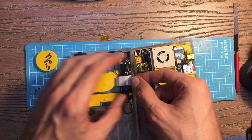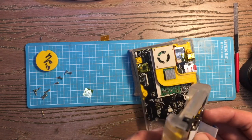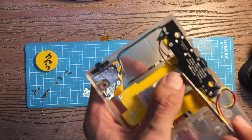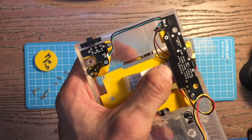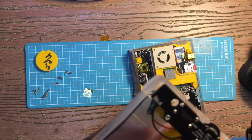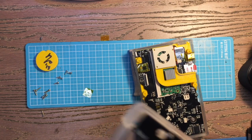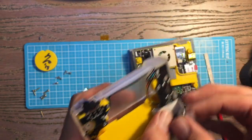Connect up the backboard between these — you can see that ribbon cable has little indentations from the nibbles on the board. Just like I did with the top bit, I'm going to smooth those down. There are little mouse nibbles from where the board was removed from its main piece, and you do not want that compromising the flat panel connector. You can also just knock them off with diagonal cutters. Much better — not screwing up my flat panel connection.